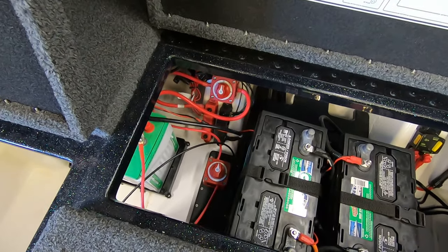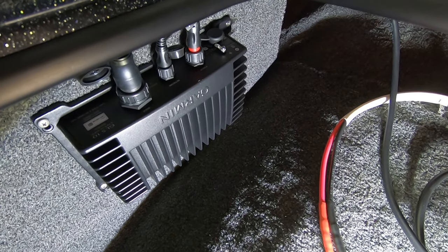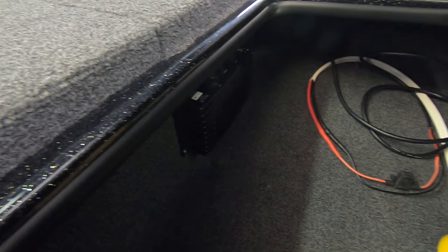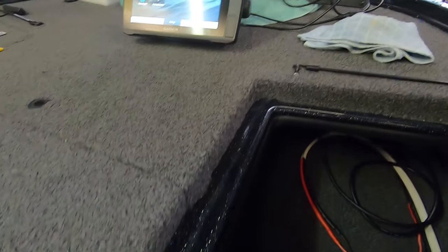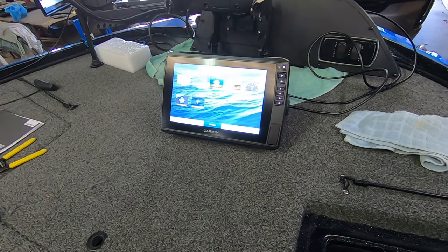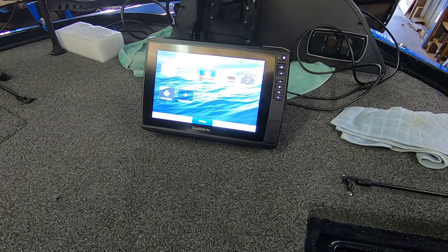Now that all the power is connected, we can plug in the black box and make sure it powers on. I was super nervous for a minute because I couldn't get any power indication on the black box — then I realized it won't light up unless you have your chart plotter connected. So maybe that means it stays off whenever the graph goes off. I'm going to leave the inline switch just in case I want to use the graph for mapping without having the black box and transducer running, but maybe the kill switch is just unnecessary.